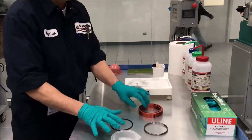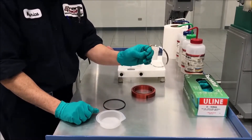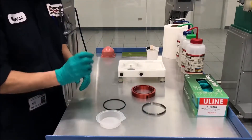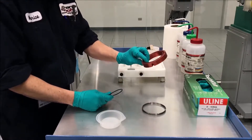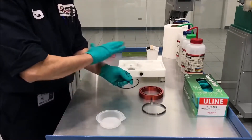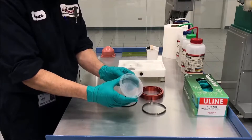We have six major components that you have to keep in mind. The doctor blade, which is made out of a carbide material — very important to keep over a table whenever you're working with it because it's very hard and fragile. We have the space frame unit which everything will assemble into, including the o-ring rubber ring for suspension in order to doctor well, and also the liner which is the container where we'll have our ink.